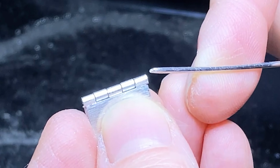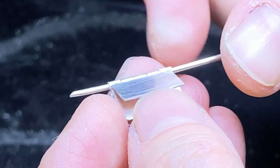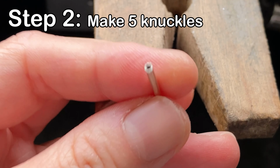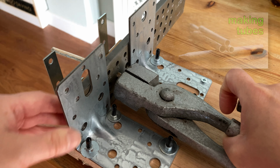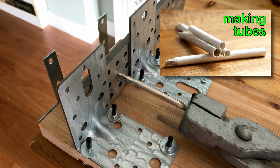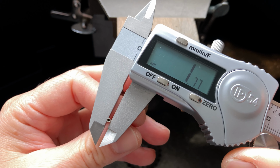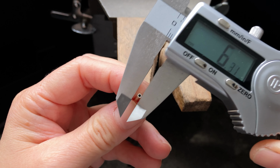Next, I need to make a hinge that is made from 5 knuckles and a pin. This will join all the 3 pieces together. Here's the silver tube. I'll show how to make one in the other video. Check it out if you are interested. The link is in the description below. The one I have here measures about 1.8 mm diameter. I'm going to use this tube to make the knuckles of my hinge.